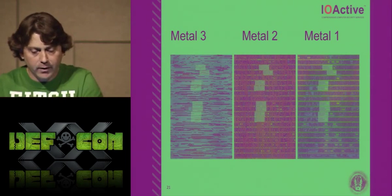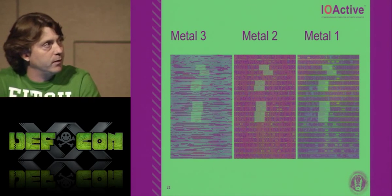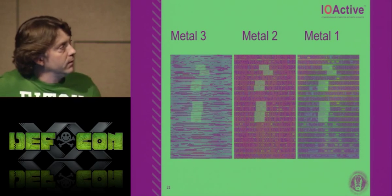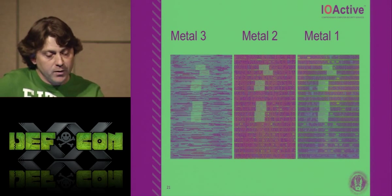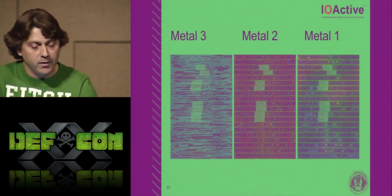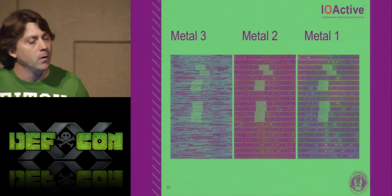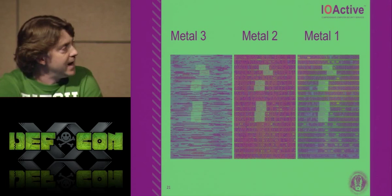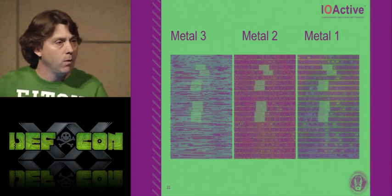So looking at the 350 nanometer chip, I did some extensive work on this a few months ago. You can see here in the middle of the CPU, which we'll get to after the slide deck's finished, metal 3, metal 2, metal 1. These had been overlaid on top of each other, and then I separated them and put them into the picture. Those are the 8 tri-statable drivers for the ROM output, the decrypted ROM fetch.